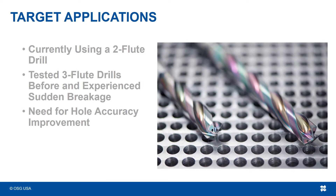If you're a person regularly using many 2-flute drills in your day-to-day and you're looking to improve your drilling productivity overall, switching to the ADO TRS 3-flute drill could be the best route for you. The addition of the 3rd flute allows this tool to penetrate material faster than a conventional 2-flute drill, so you should be able to see a productivity improvement right out of the gate.